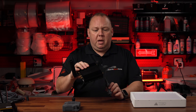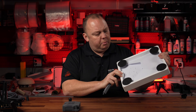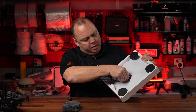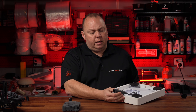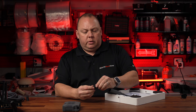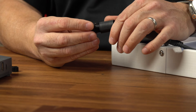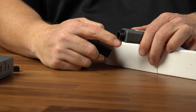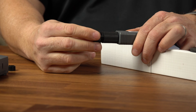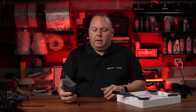If you plug this into like a Peplink BR1, you might blow it up — so be very careful. This is a Starlink Mini accessory, not to be confused with 12 or 24 or any other voltage accessories. The concept here is that you plug this into your dish — you've got your power input and your Ethernet here, and you're done. Then this can sit and ride down here or wherever, and you plug a regular Ethernet in here with this weatherproof boot. We have installation instructions that come with everything, but essentially the Ethernet cable comes through here and sits inside of this weatherproof boot. Then you turn this, which tightens the cable gland around it to make this all waterproof. On this side you've got an O-ring that's included in the kit, and when you twist lock that, you've got a waterproof seal giving you one single Ethernet out that will go down into your cabin into this device.